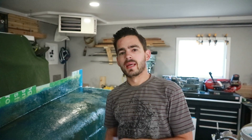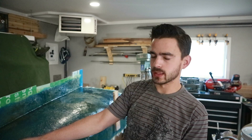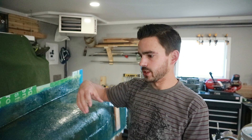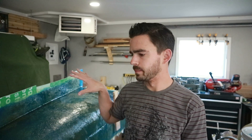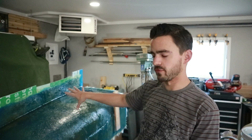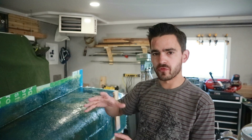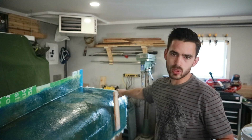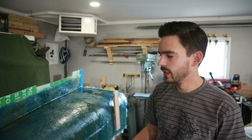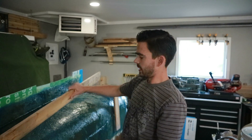We're back in business. I skipped ahead a little bit — I was getting bored of filming fiberglass work and I'm sure you guys were getting bored of watching it, so I just came out and fiberglassed the whole thing. We've got probably three to five layers of glass over the entire mold section including flange, so this part's pretty well done. The one last thing I want to do is add some rigidity — I've already glued on one block of wood at the back with gorilla glue and a hot glue gun, and I got another one cut to glue on.